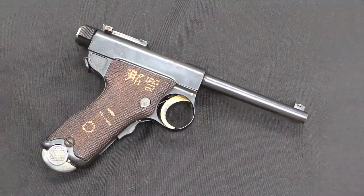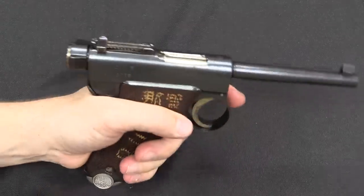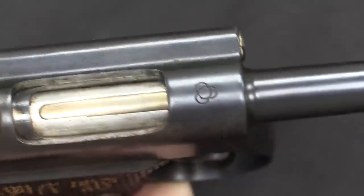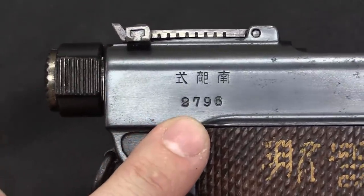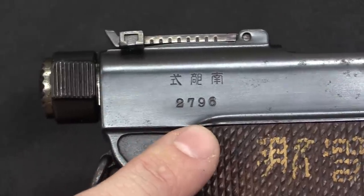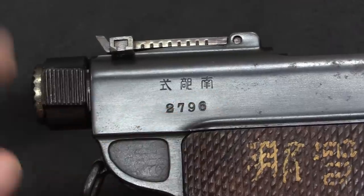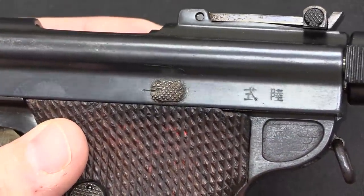We'll start with a basic overview and some markings. The pistol is chambered for 8mm Nambu — that is 8x22 — a little bottlenecked cartridge, with a Luger-like detachable box magazine. On the top of the chamber we have the marking of the Tokyo Artillery Arsenal, which is where this was manufactured. On the right side we have the serial number. For the Tokyo Arsenal these picked up from the end of the Grandpa Nambu serial range, starting at about 2450 — this is a very early example. Guns made at TG&E start at serial number 1. We also have a three-character marking that translates to 'Nambu type,' and on the opposite side a two-character marking that translates to 'Army type.'